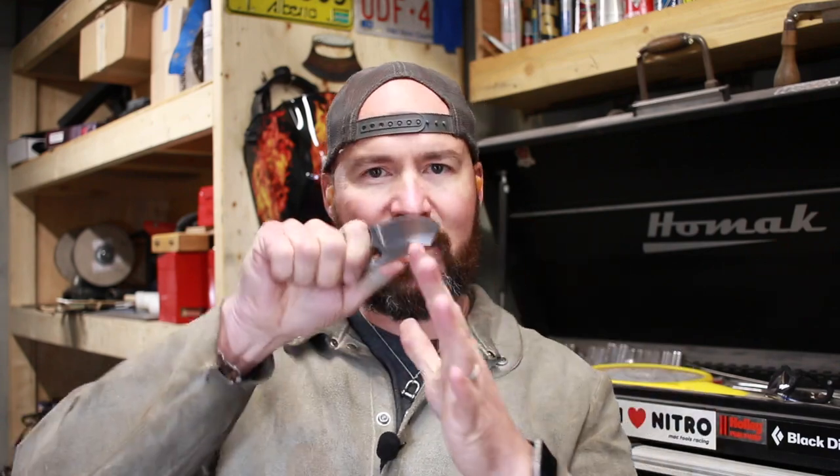And it's quite a small scale, it's not like it's way more surface area, but in theory when you do the math, a straight line is a straight line. If you curve it, you've got more distance, more surface area that you're actually using to keep the grind nice and flat. So maybe that's what it is, I'm not entirely sure, but I definitely find it more challenging to do freehand flat grinds. Somehow the hollow grinds just seem to come. Once you've got your initial bevel in there, boom, it seems like you've got a great place to work from. That's just my thoughts, but who knows?